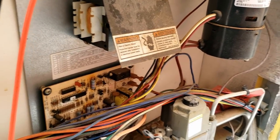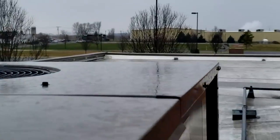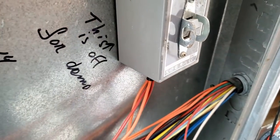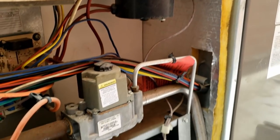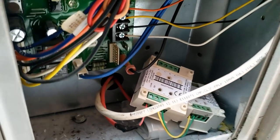It's blinking happy fast — but is that going to make it come on? Looks like it's wanting to. Something about this is off for demo mode or something — I count on whatever. I bet when that thing tripped it probably just ran the draft motor, because it was probably default — kind of like when a limit on a furnace trips, the fan blower runs. They've got some automation stuff in here.